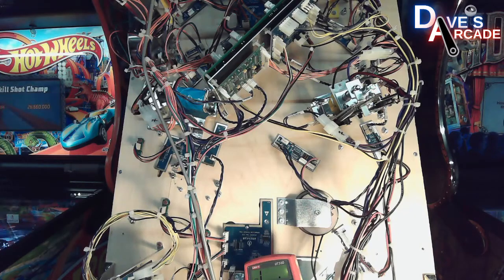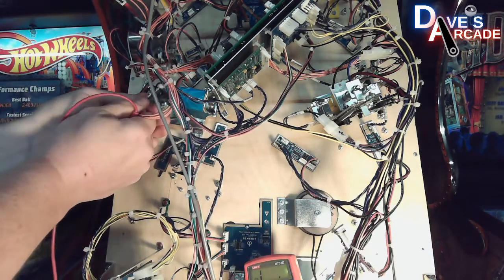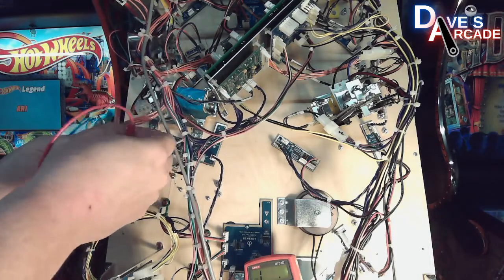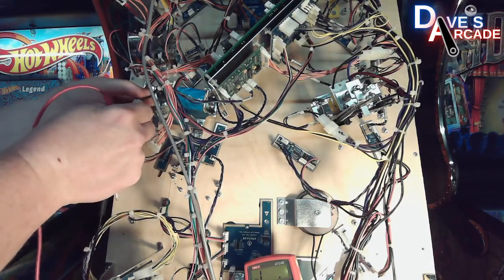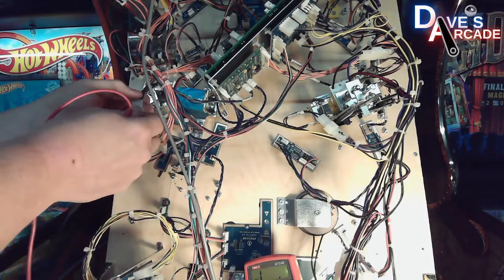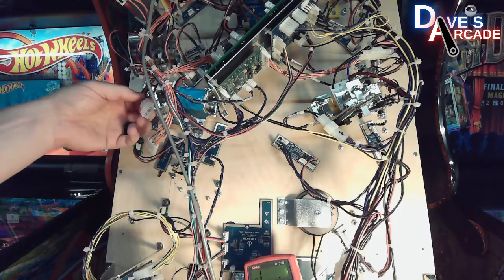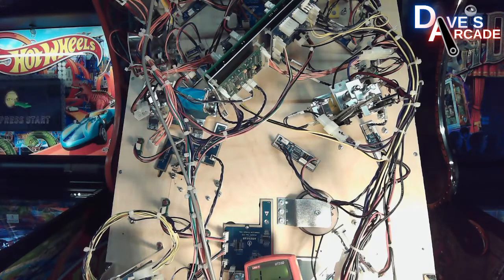So now let's talk about flipper coils, because this is slightly different because they are dual wound coils. So I happen to have a flipper coil right here. You can see that it has 3 leads going to it, and so in this case you have your power going in is the solid black wire, and then you have a black with a white stripe and then a white wire. And dual wound coils have 2 resistance values.